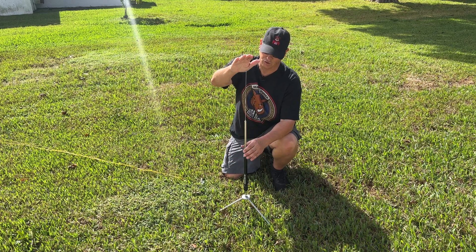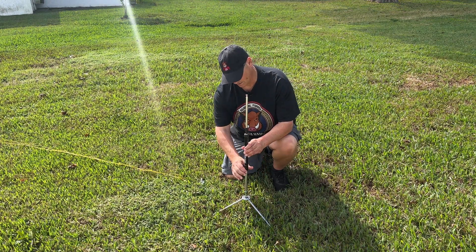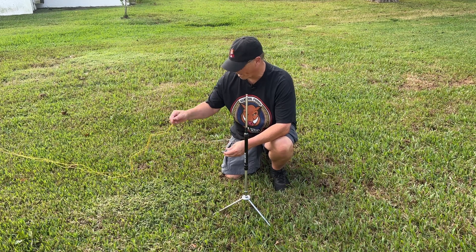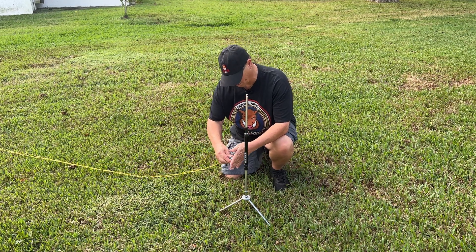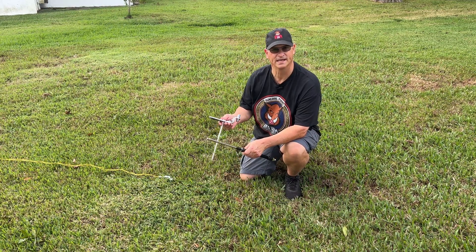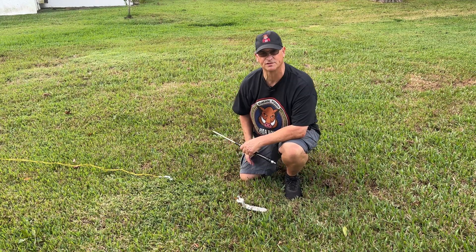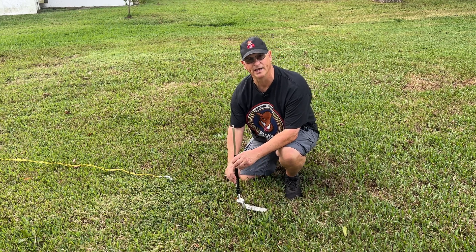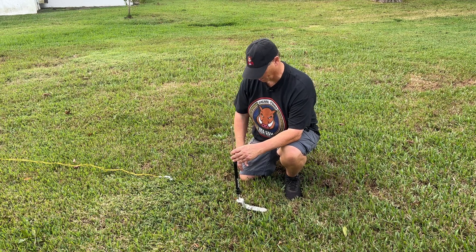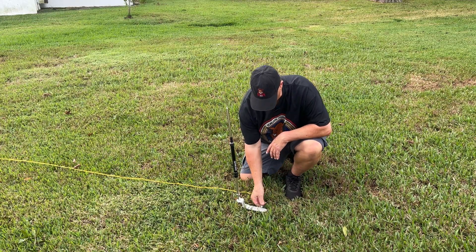You would just take your telescoping whip and telescope it up to full length. You would adjust your coil, lock the lock nut in place. And of course, who's not using the HOA Ham method for radial wires these days — banana plug, clip, ready to operate. Some of you have made the investment in the super antenna kit. I did. I need to do a full review on that antenna someday, but it comes with a ground spike. And it wants a 3/8x24 antenna, which we now have with the G Gable. Telescope your whip, adjust your coil, take your ground radials, and you are ready to operate.